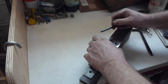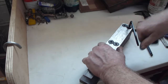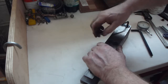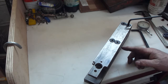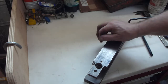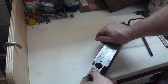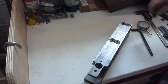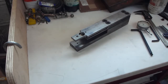I think I've got this middle plate in the wrong order, but it doesn't matter. I don't see any advantages in using the smaller size threads here. And as I'm going to make this a flexion joint in this top piece, I would prefer that it had a big thread that was capable of holding this in place as well as adjusting, rather than having a small one, which seems rather flimsy to me.